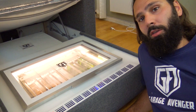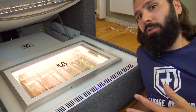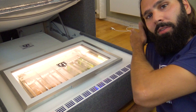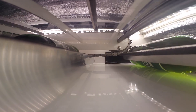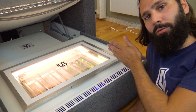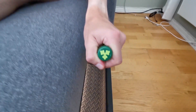Let's talk about the code a little bit. Whether you use the voice control module, the remote, or the app, the script runs exactly the same. The first thing the script does is look for a beer in the drawer — it checks the sensor. If there is a beer in the drawer, it drives the drawer out and you take the beer. If there's no beer in the drawer, it drives the chain around, pushing the paddles to push the next beer ready to go. Once the beer is in the drawer, the drawer comes out and delivers.